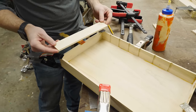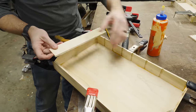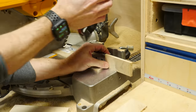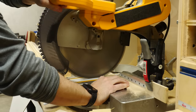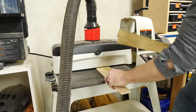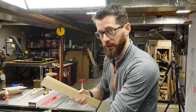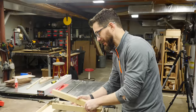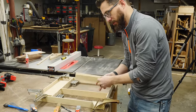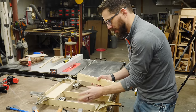I've got this piece cut as a test. I'm going to trim it down just a hair to get it to fit in there, and once I get this one perfectly fit, I'll make the rest of them exactly the same size. I've got all those pieces cut down — these are going to be glued into the top tray, the daily use tray, and these are actually just going to be set down inside these slots. I only made four of them even though there are seven different positions, because these are going to be adjustable. As we put different things down here and have different needs, we can move them left and right to make the gaps bigger or smaller.